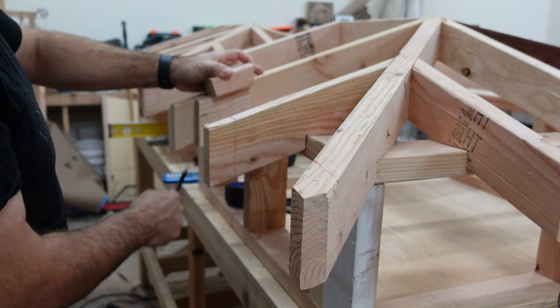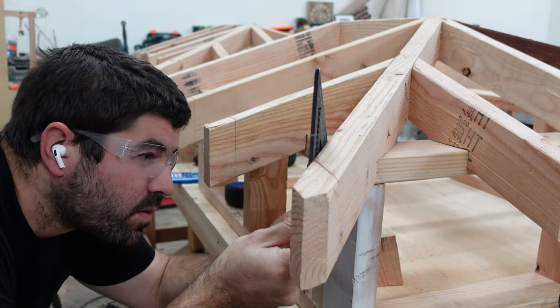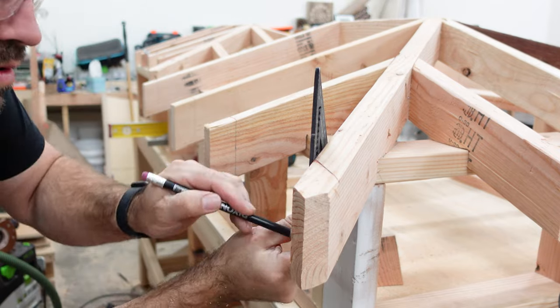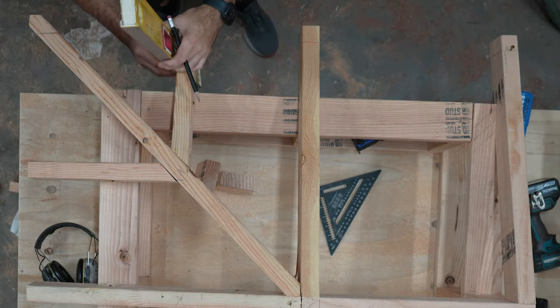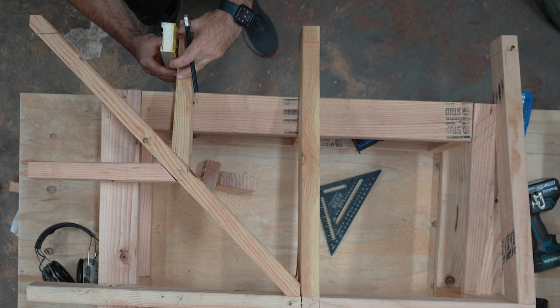To mark the line on the hip I cannot use my jig — I need to use my speed square, lining up the 4/12 hip and valley number to draw the plumb cut line. Alternatively, to mark all of these plumb lines you could use a level. This is a lot more tedious, but it can be a good way to check and make sure you were using the correct markings on the speed square.